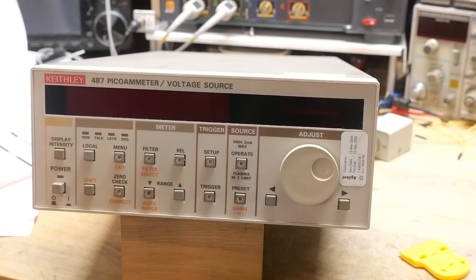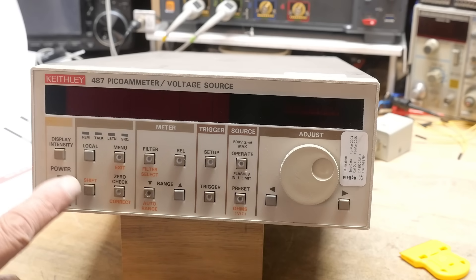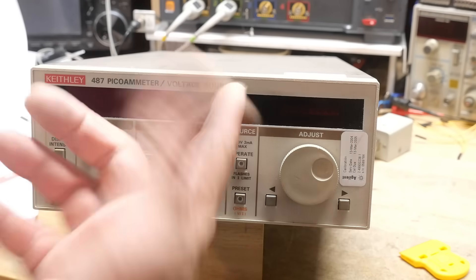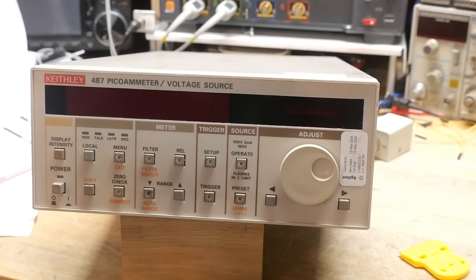What's on the bench? A favorite friend brought over a Keithley — and I love Keithley. Keithley is most famous for low-current measurements: pico-amp current meters, pico-amp current sources, really small amps. This is a Keithley 487 picoammeter slash voltage source. The 486 is just the picoammeter, and the '7' adds the voltage source. With current and voltage you can measure resistance, so that's why this comes in handy.